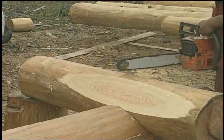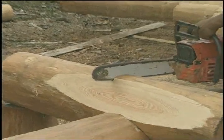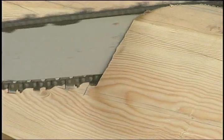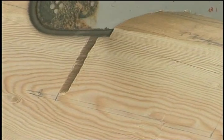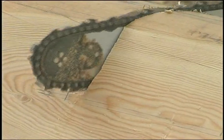Score this notch and cut it to the depth of the second level line, or an additional 3 millimeters. Make a wider cut at one end. This will allow you to observe the tip of the saw as it goes through the plunge cut.